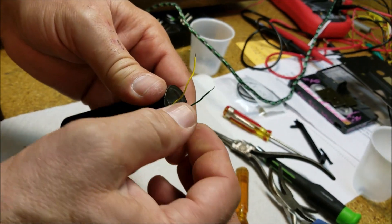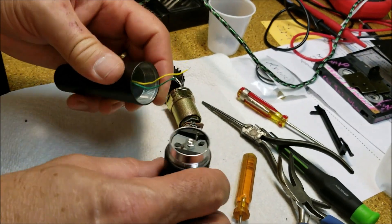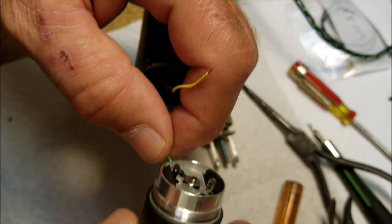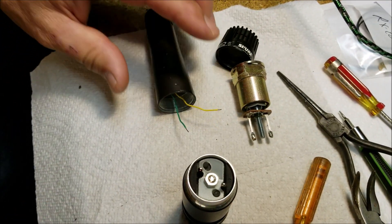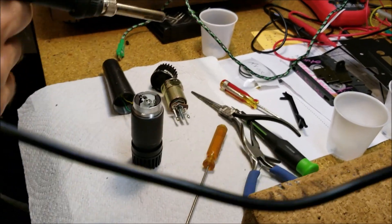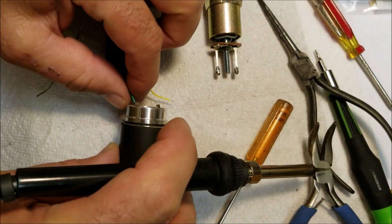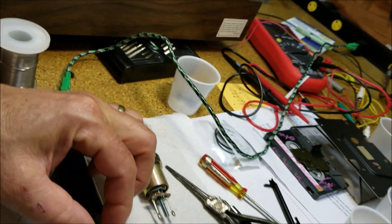The part I left out: the green wire and the yellow wire are supposedly how you differentiate between a real one and a counterfeit. On the replacement cartridge, the positive is coated red, and you're going to solder the green wire to it. I'll go ahead and do that — I'll tin the leads here. It's kind of tricky, but I can still do it.